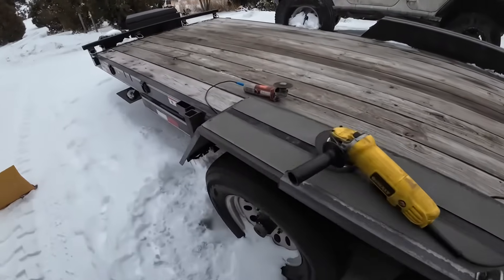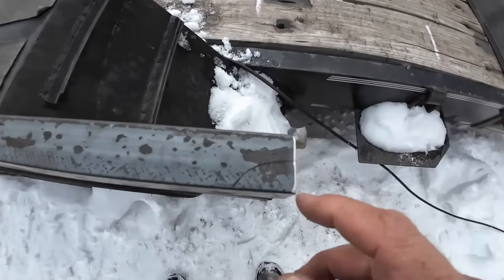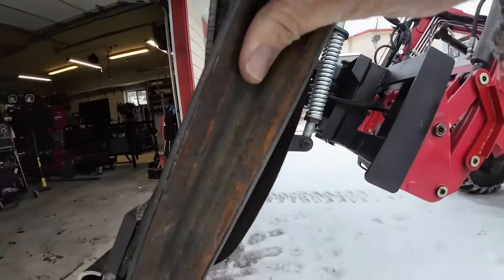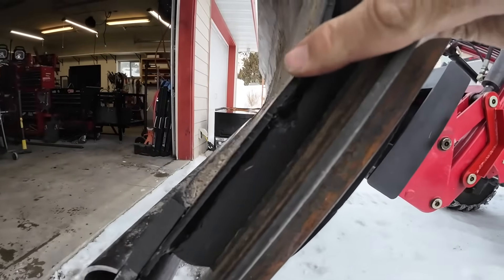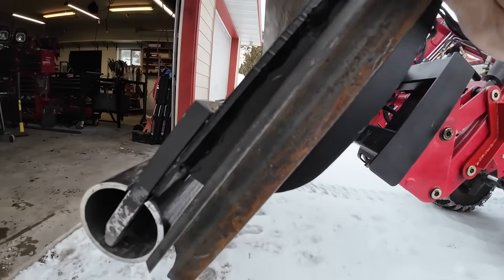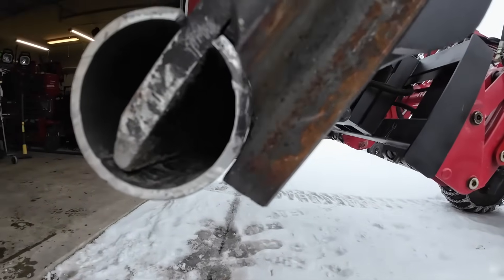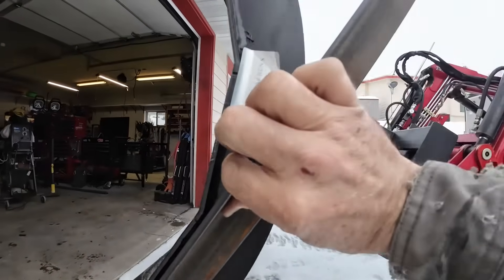Found another use for the drive-over fenders — they're pretty solid and work great as a steel-working bench. I just made a little radius mark and traced the radius along the steel. Here's how it fits up: this angle is going to fit flat against here. I can't push it all the way flush with the front of the blade because there's a bunch of weld right there that I'm not going to cut out. But basically it's going to sit right here and give me a little bit of a radius to weld to. It's not super tight but pretty close and it'll give me a good weld. Then I'll cut it off up here so it doesn't stick out the top.